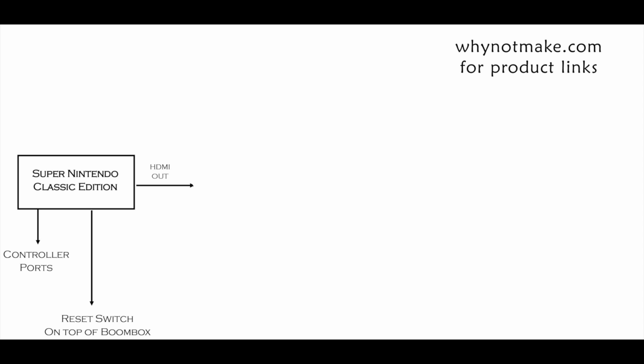I am hard resetting the system with just basically hard resetting the battery, meaning that I'm not even using the power switch on the console itself, which is probably dumb, but it's working. It's not crashing or anything. The reset basically is what takes you back to that home screen and allows you to save your state or pick a different game. That's important, and so I did actually take that button and solder that and wire that up to that momentary switch on top of the boombox so you can physically press it and actually reset the console.